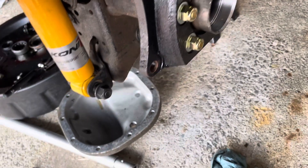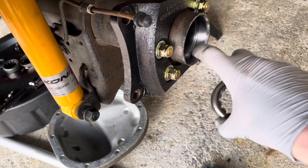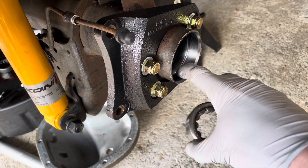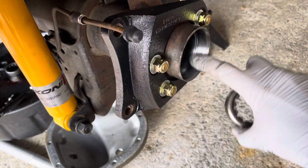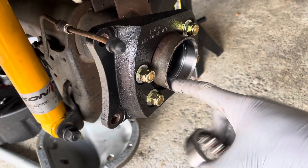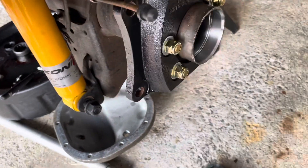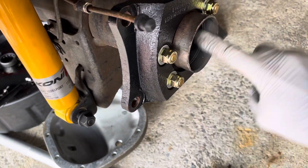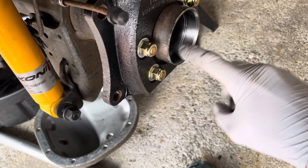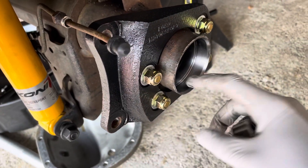He showed how to put this back in. What you do is clean this edge up. You may have some scratches — you can see I scratched the bore here a little bit. I took some 120 sandpaper since I didn't have any emery cloth, sanded it down and cleaned it out. Then I took some red Scotch Brite and sanded that down too to give it a smoother finish, working it until I got the sharp edge out.